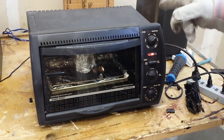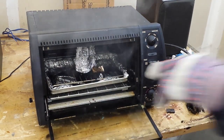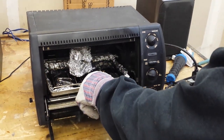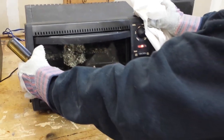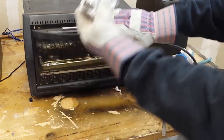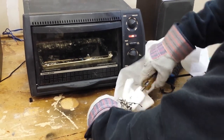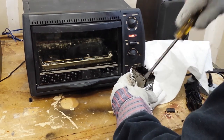Now that we're done taking a look at my new junk, this has been in here for a while. There's plenty of smoke coming up out of this box. Whew — it does make a smell, guys. If you do this, do it in your garage. Do it in your basement and your wife will have a fit — ask me how I know that. Let me put this back in for just a minute. I'm going to grab a handful of paper towels and see if I can't wipe out the rest of that tar. What you're going to need: some paper towels, a big screwdriver, and maybe a gas mask. You take this guy and just shove a wad of paper towels down in there, and real quick while it's still hot, you wipe it out and get that tar out of there. Sometimes you have to do more than one iteration of heating and wiping.